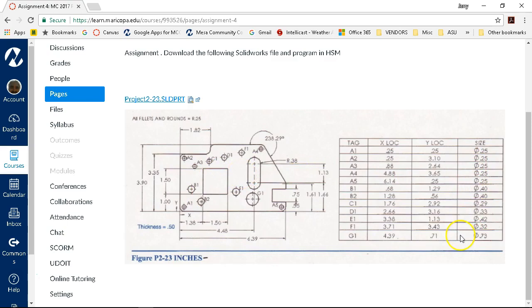There are probably eight different tools. How tight a tolerance do we have to be on these holes? If I can take the smallest drill — say the 201 — well, these weren't called out as quarter-20s, but I changed the four holes in the corners over to quarter-20. So if you're using this drawing you can stay with their sizes to make your own. But if you go into my model, I turned this one into a countersink so that we'd have something to talk about countersinks with.